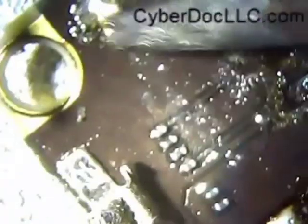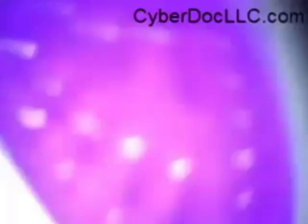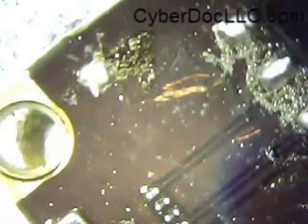You also want to tin the tube connection in the back — you definitely want to do that. Because the way you lift out the battery connector, if you don't tin the back connector and you solder only those two joints on, then when you remove the battery again, that connector is going to get ripped right out — or after a few times it will get ripped right out. This is why some people are not comfortable doing this repair on their own. They can do the first four pins with a small soldering iron — no problem. But the two solder joints on the back, they're not comfortable with that because they don't know how, they don't have the proper equipment, or the low melting quick alloy solder paste.